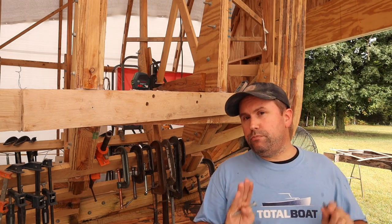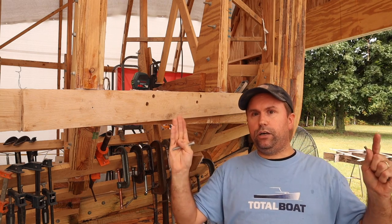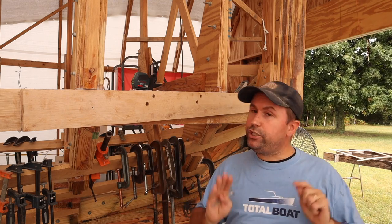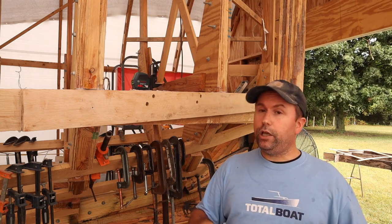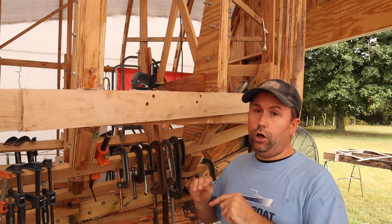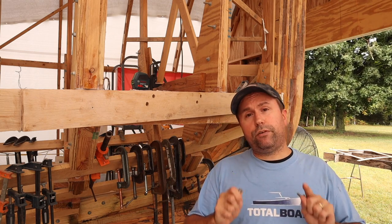And those go hand in hand for adding to a nice long life for galvanized fasteners. Now, a third material you might hear a lot about is stainless steel. And a lot of people think stainless steel is a complete umbrella material, and it's perpetual, never-ending, never-failing. And that's just not true. Stainless steel comes in several different grades. Only a few really should be used on boats, and no grade of stainless steel should be used below the waterline for fasteners.